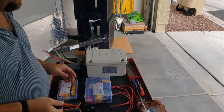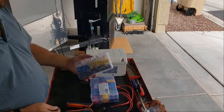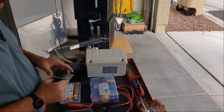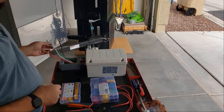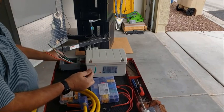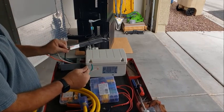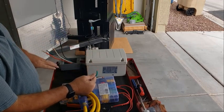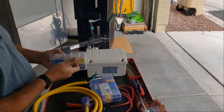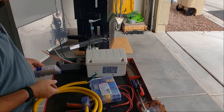That's the next day — Amazon finally came. So I was waiting on this heat shrink kit, this crimping tool, and these crimps. The reason being is this outlet is really intended for solid core or solid strand wire. The stranded wire tends to mush out underneath the screw, and it's not really intended to put more than one wire in there. But because this is an adapter, that's kind of what I have to do. So to keep the wire from spreading out, I've got these crimps — I can put them in and keep the wire together, then use heat shrink to strain relieve it.